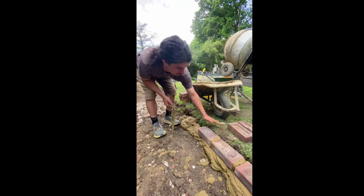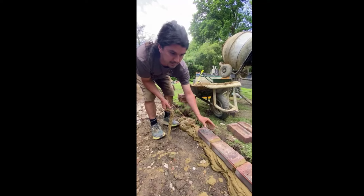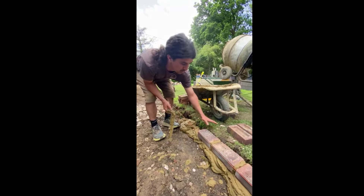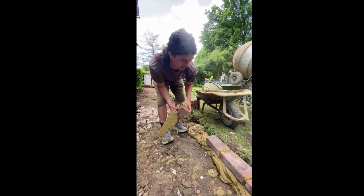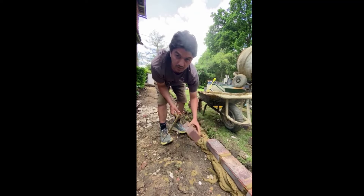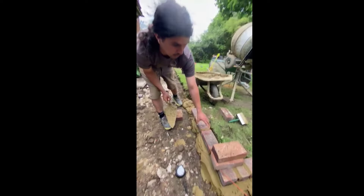Just be careful and take your time — fill it to the line, look at the ground height as you lay it. If it's looking too high, you just tap it down a little bit, or bring it down over a course of maybe two, three, or four bricks, so it looks fairly even. Otherwise you'll get a brick that looks wonky and it doesn't really work.